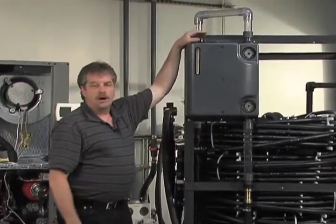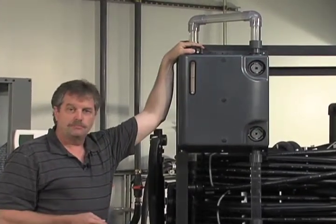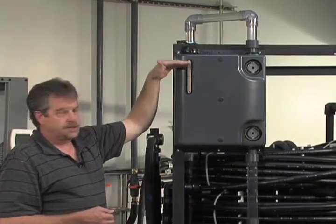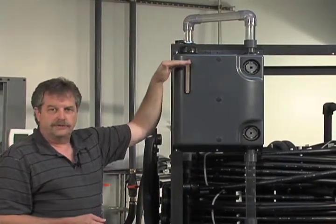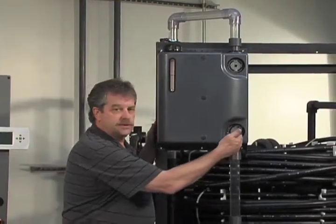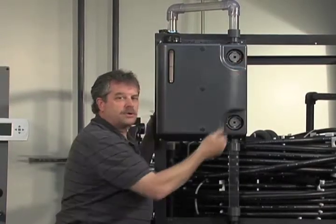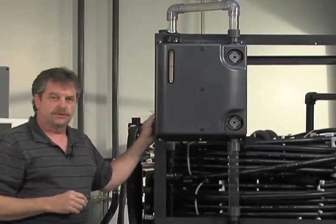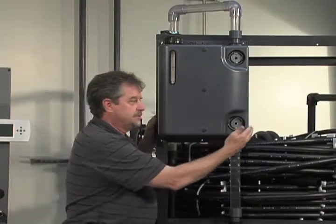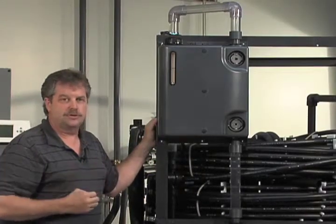It can be either pressurized up to 13 psi and make it a pressurized system, or it can be a non-pressurized system. Again, some of the features, you see a sight glass here so you can tell the elevation of your fluid level in the reservoir. But one of the things that we really like about this particular tank is the composite three-way valve, similar to what's in our typical flow controllers. What we like about this is that you can put it in the position that you see now, and it bypasses the tank so you can properly flush a ground loop.